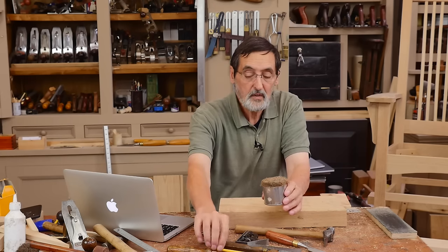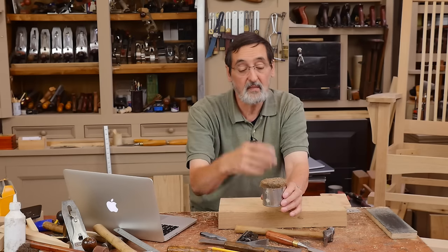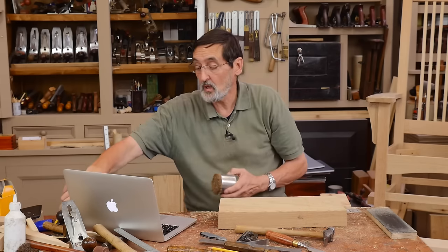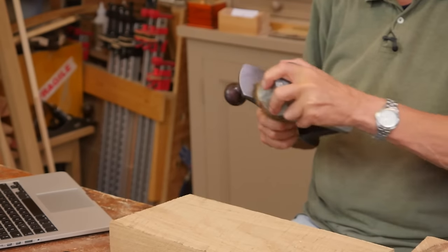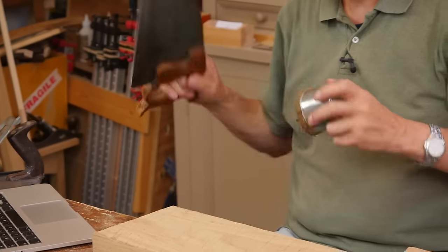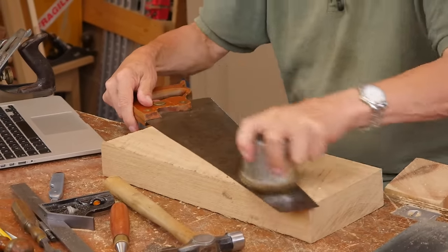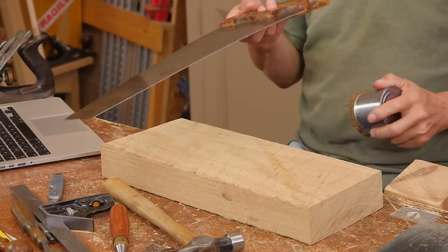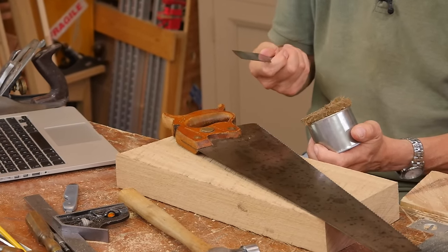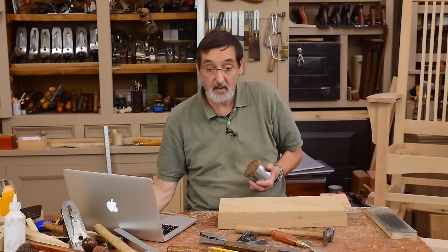Just top this up — put the oil in, circle around, leave it to soak in, then go back three months later and do it again. You just soak the underside of your plane like this, you can soak the side of your saw. I do this all the time — it really reduces friction tremendously. Sometimes if I'm working on a very fine joint, I'll do the flat face of my chisels too — it really helps reduce friction.